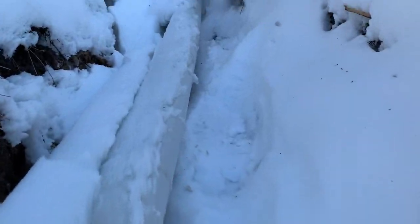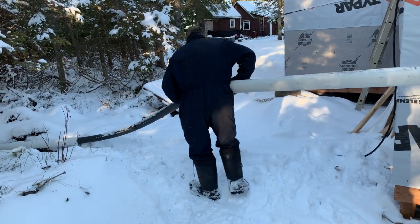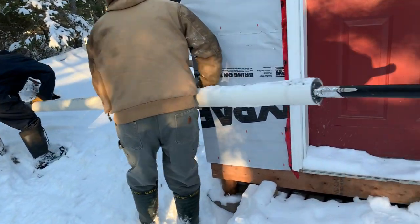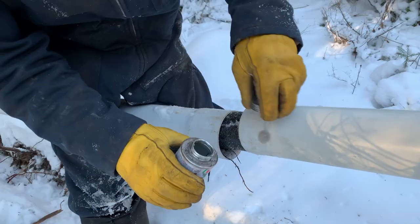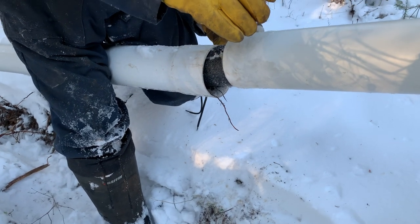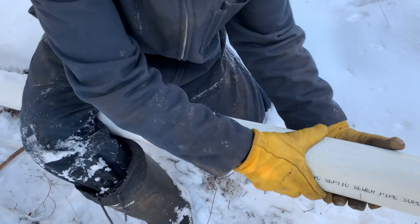It's been a few days now and we've got some snow, but at this stage we're putting PVC pipe on top over the insulated water pipe. That protects the insulation and the water pipe, and also stops the foam from getting waterlogged over time. We just put some PVC cement on the joint, then put the pieces together, and we're good to go.